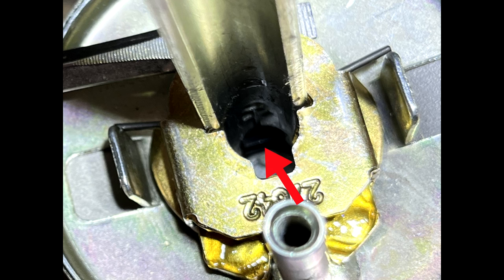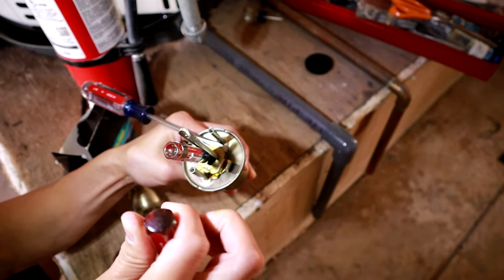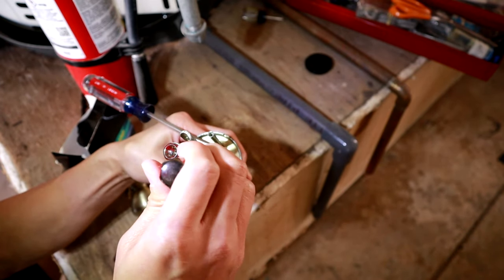This is one of the tabs here on the throat side of the doorknob. We're going to take two skinny screwdrivers and jam them on both sides of those tabs and then push it out simultaneously. Go ahead and take a skinny screwdriver and get it behind that tab and push it in there.